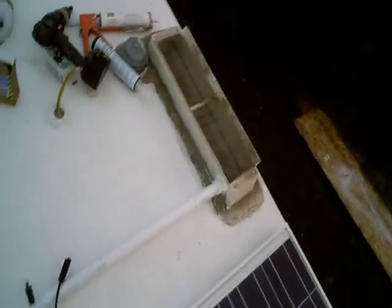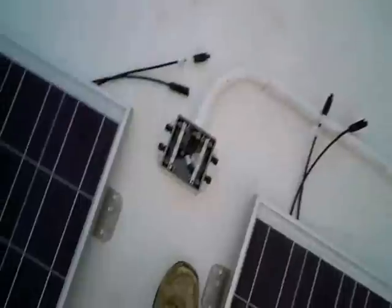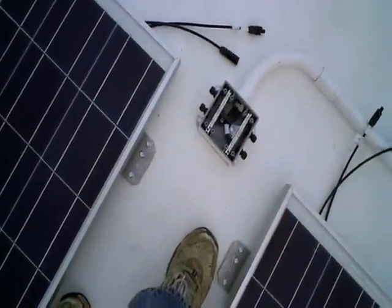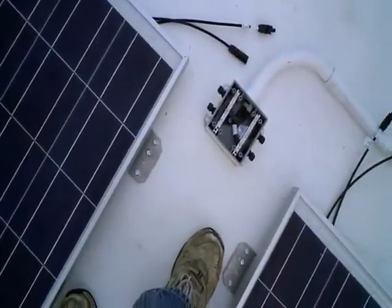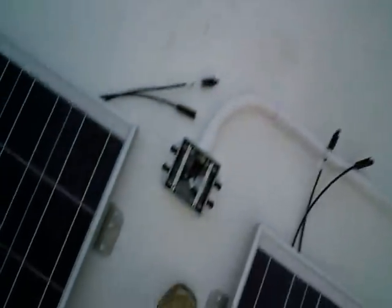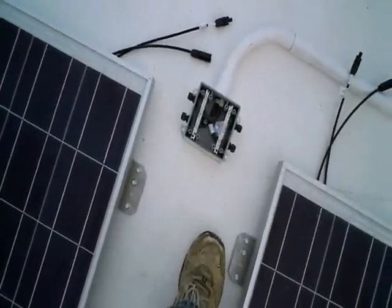That'll be all for now. I'm not calling for rain, but I'll put the hood over that vent just in case and the lid on that box. This putty is actually pretty waterproof by itself, but it really needs a coat of lap sealant all over the bracket and around to the side of the trailer. I'll clean up the roof a little with mineral spirits before I seal it, and I'm getting pretty close to being done.